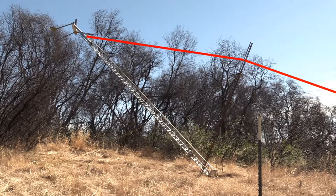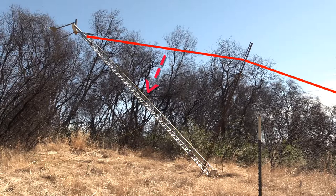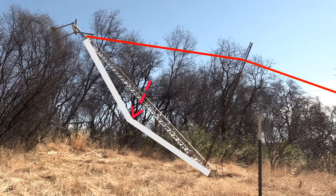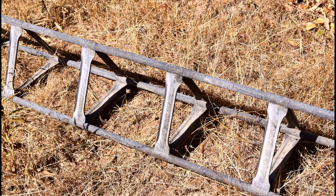But if this tower were longer, or was of the thin wall tubular type, this center would likely bow down when trying to lift or lower it — possibly leaving the tower permanently bent, let alone folding up and collapsing to the ground. Now this bending weakness might also hold true for this other lighter duty lattice tower I showed you, with thinner pipes and no diagonals.